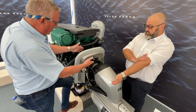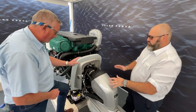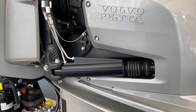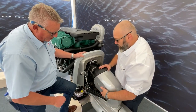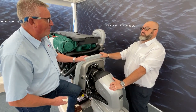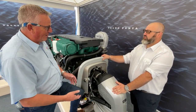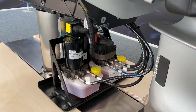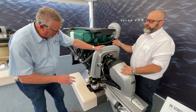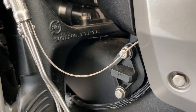The yoke system is completely different from the earlier versions — the old version used to be a steering system as well. This one now is hydraulic steering, full hydraulics, and you've got rams — on twins, if you have a twin setup, you only have one ram on each side of the drive and a connecting rod. This particular model on the show stand is for twins. How far this has come — next to your left foot is the steering and control rams and the ETU just to control the steering, with one for trim and one for steering.